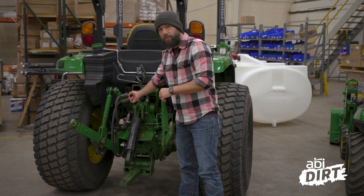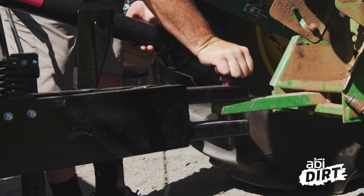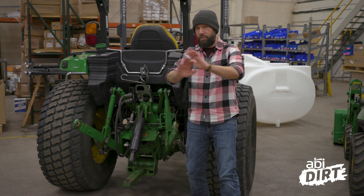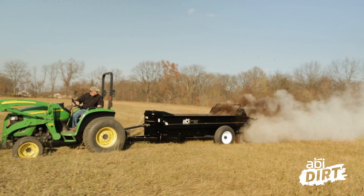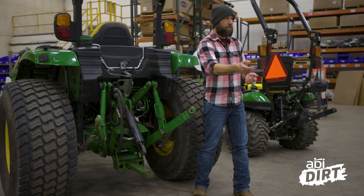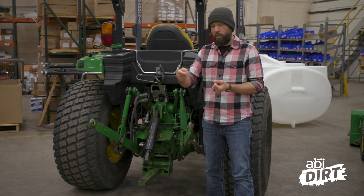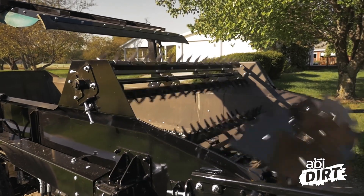You can also see we've got rear-facing hydraulic ports on this tractor. When do you use one over the other? It really depends on the attachment. General rule of thumb: if something on your attachment is moving or spinning continuously, you're going to leverage that power takeoff system — the rotation of the PTO shaft going to some gearbox. Think rotary mowers, tillers, aerators. We've got PTO spreaders here at ABI Attachments. Anything that needs to be moving continuously is a great application for the power takeoff system.